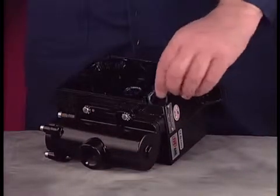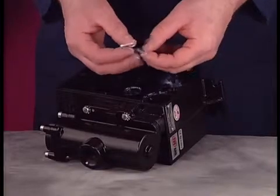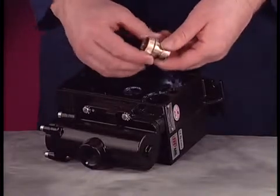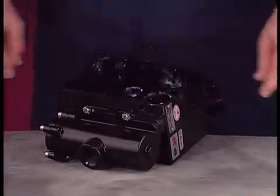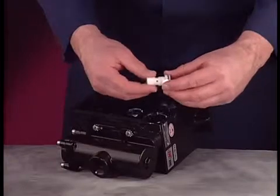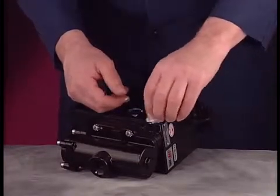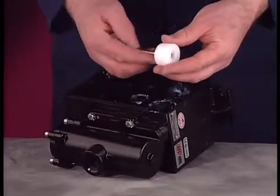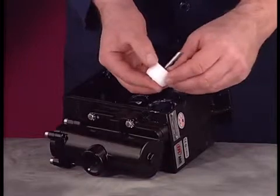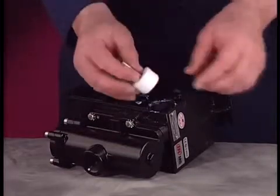Install a new O-ring on the outer diameter of the pilot sleeve. Insert the sleeve into the center body, being careful not to cut any O-rings during this step. Lubricate the new pilot piston and insert it into the sleeve. Insert the pilot actuator pin into its sleeve. Install new O-rings on the actuator. Insert O-rings into the center body, followed by the sleeve actuator assemblies.